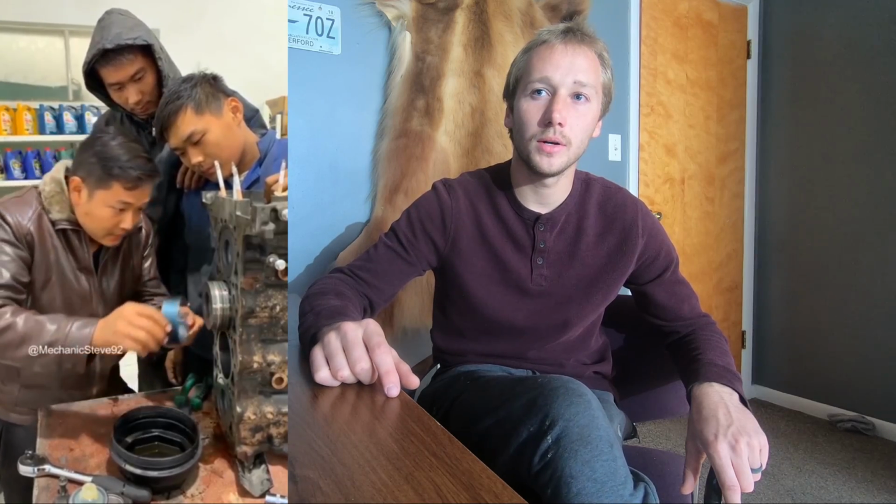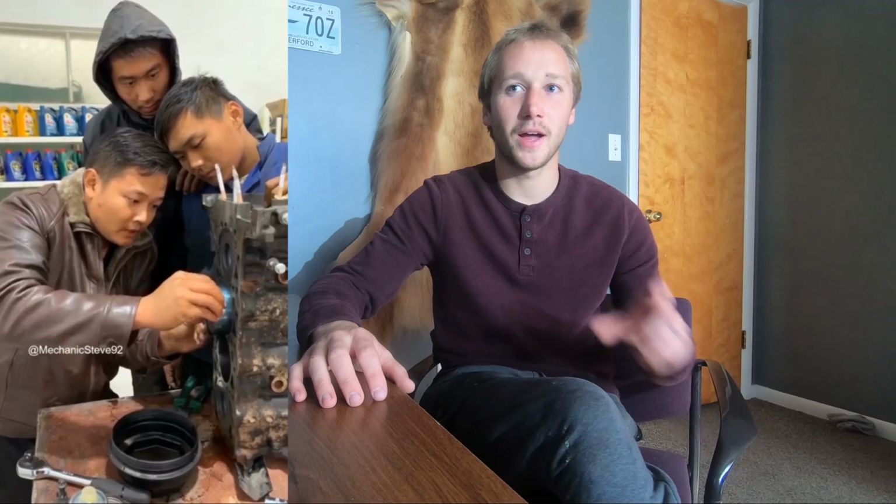And I'm just caught up here interested. Okay, I was wondering if he was going to put something on there to clamp those rings down, or if he was going to try and pinch them in one at a time. But that'll compress the rings, that'll tighten the rings down so you can push that piston into the motor. So I'll just give it a little tap. He's got them squeezed down. And tap, tap, tap, it'll go right in.